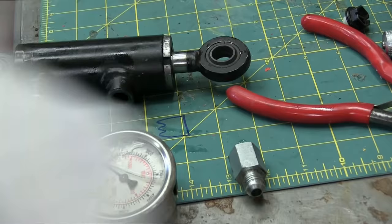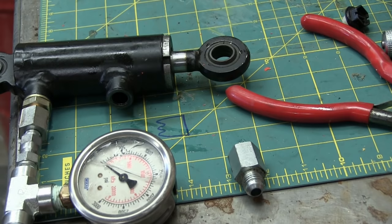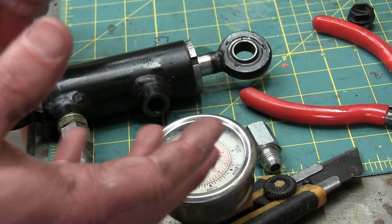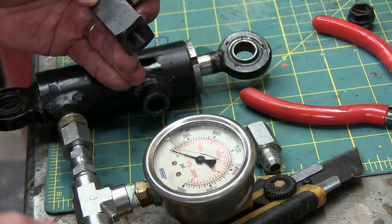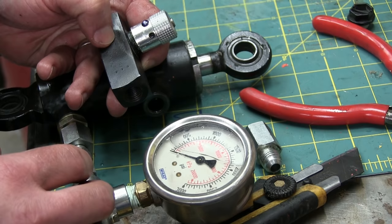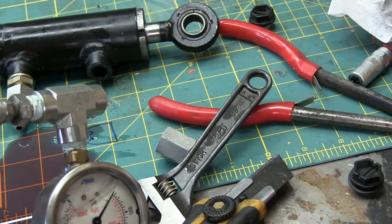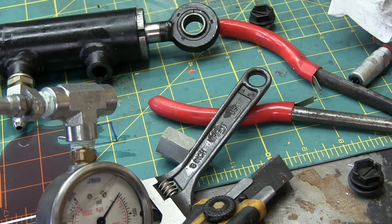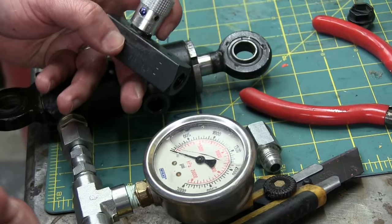We've got the 3000 PSI gauge in there - 20,000 kilopascals. Pump it up. I've been pumping for five minutes and the needle hasn't even unpegged. It goes to show you can't make an egg without busting a few omelets. Here's the deal - I forgot that there's no check valve on this pumping element because it's grease; it's so viscous they pump it once and they're not worried about it coming back through. However, oil is quite a bit less viscous than grease and it comes back through. You can also see there's a pretty steady drip that hasn't abated - there's a leakage path in the pump itself. They must be relying on the viscosity of the grease to self-seal. It's not the best pump, but it is cheap. We need to add something important: a check valve.